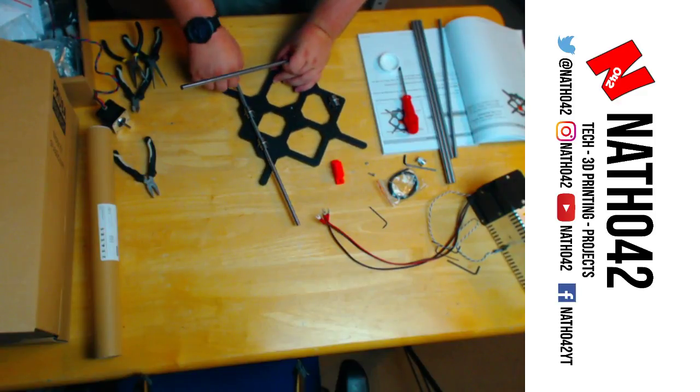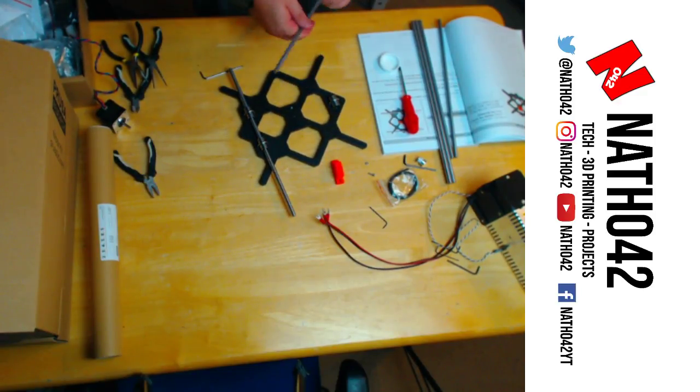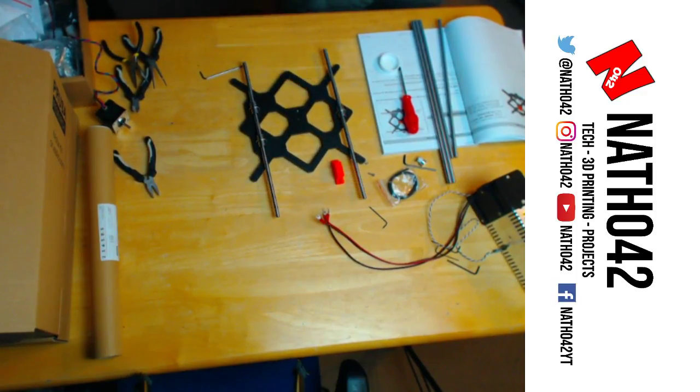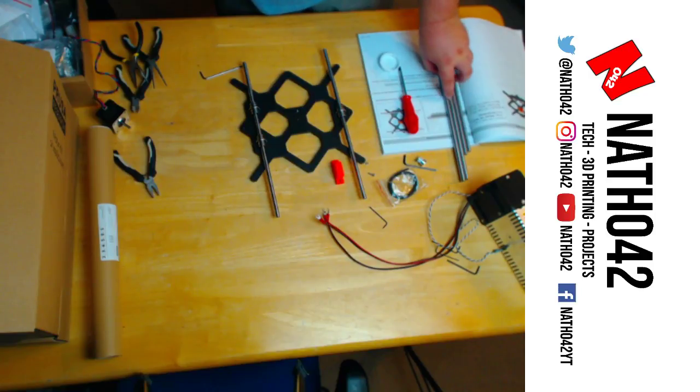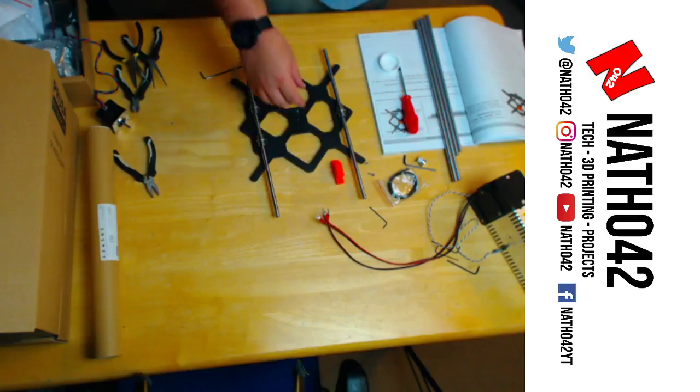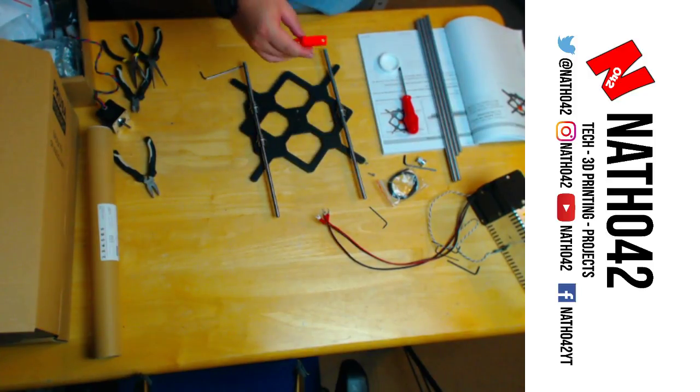You know what? They seem okay. Do you guys ever grease your rods or whatever? Because for the Anet A8, I found that using a little bit of motor oil on a rag, wiping it over the rods, not these types of rods, but the screw rods, the lead screws even, helps keep it a bit quieter. I don't know if that's something that everyone does.